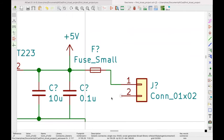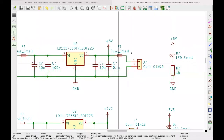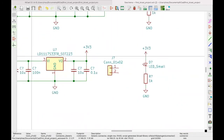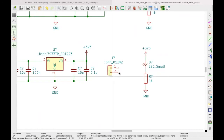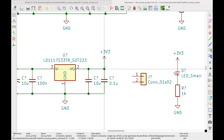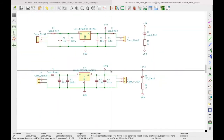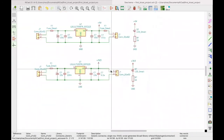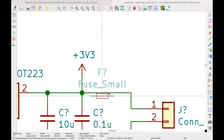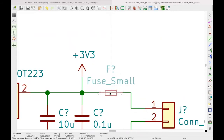We wire it here, connect there, and this way we have our regulated output. The LED is not passing through the fuse, but that's fine since it can't draw more than enough. For the other rail, to make the fuse face the right direction, hover and hit Y. Then press M to move, place it, and wire it up. To slot in a fuse on a wire, you don't need to delete anything — just place it on top of the wire and it will break the connections and create independent net names.